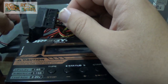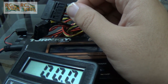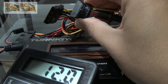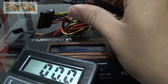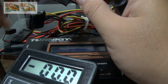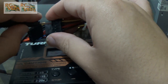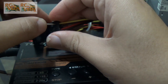I will power it on. Let's do this. Black — with yellow, 12 volts. With red, 5 volts. So we need the black and yellow cable. Let's turn it off first. I will use this to remove the wire. And you are not destroying your power supply — you can use it afterwards, or put it back in a computer if yours breaks.